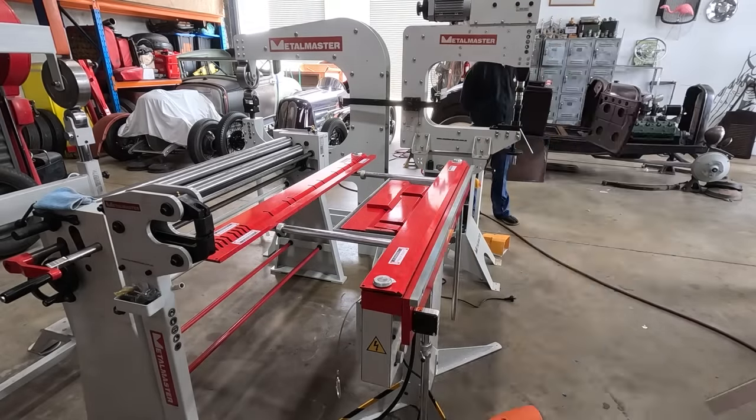Okay, well, I did get some of the bow back in there, the David Bowie, but it's not quite enough. Right in the middle, I know I did a pretty serious kick on the shrinker. So I'm gonna just flatten out this one spot, stretch it again. I know it's just right in the center. I can see the flat in there. I don't know if you guys can or not, but the flange did get turned. It needs a little bit of tuning, but it's gonna be fine.